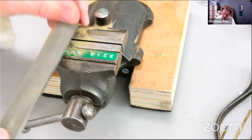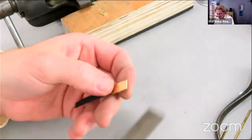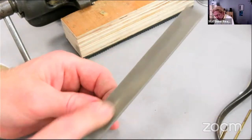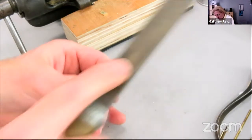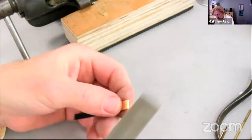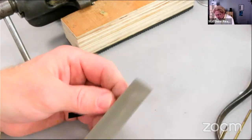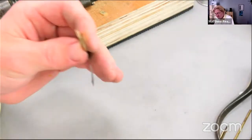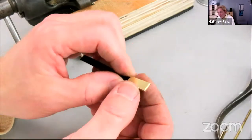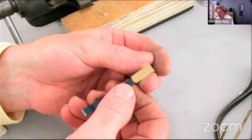You see this on the back of things like bell standards on French clocks where they've been sort of forged round. They don't leave them kind of squidgy. They file the end flat like that and then just file on again in your hand. A couple of bevels. The other side. So there we are. You can see that. Looks dead smart now. Well, in my humble opinion, and pretty much, in fact, they are invisible rivets.